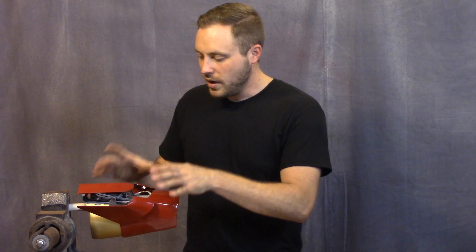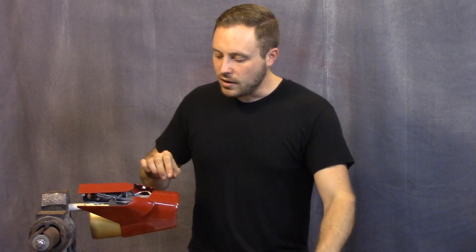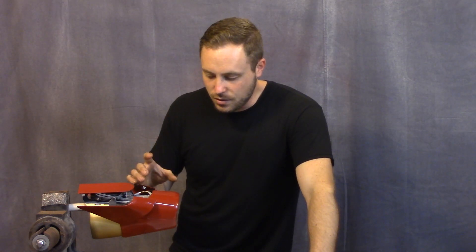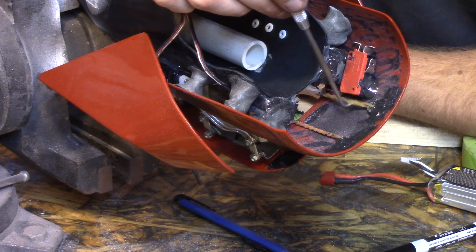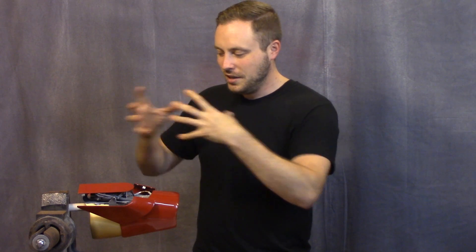After I added those guides it got to the point where this wouldn't open at all, so I started trying to figure out a way to aid the front servos. Then I thought maybe I had cooked the motors from them pulling so hard against the mechanism and they were just dead. So I added rubber band guides to the front inside to pull on the servo arms to try to get them to help open the whole mechanism.